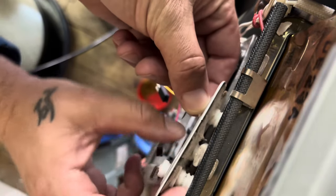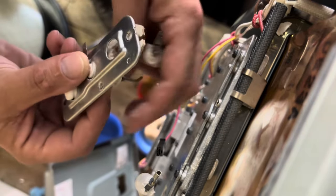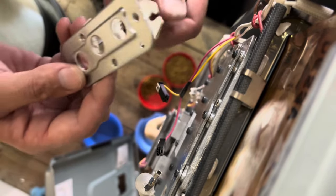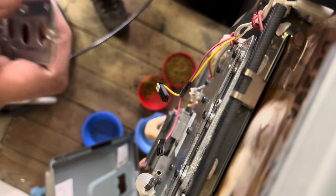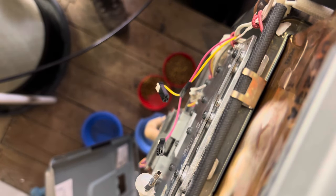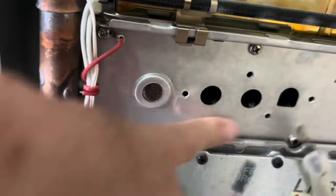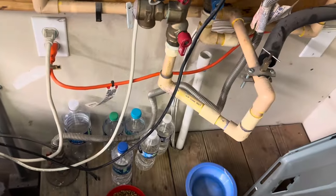All three are loose and separate, so we're just gonna take these out and pop it through the front like this. Get rid of the old gasket — it was torn anyway. We're gonna make sure we have a nice clean surface here before we put our new gasket and igniter on, and make sure the back of our plate is clean too.